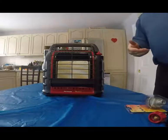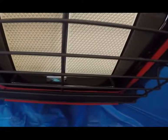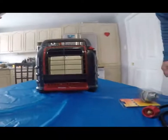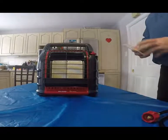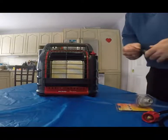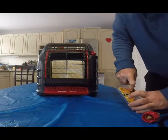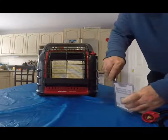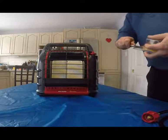We're in pilot mode — the pilot light is working well and it's heating up. Once you have this working, let the pilot light run for a bit to heat up all the parts. While it's doing that, let me open up the filter to show you how the remote filter setup works. This is the Mr. Heater gas filter, and it allows you to run hoses that aren't Mr. Heater-approved hoses.